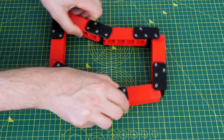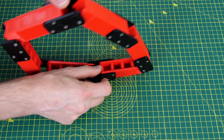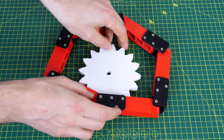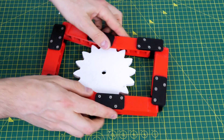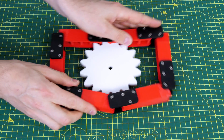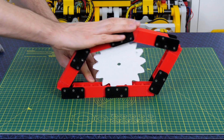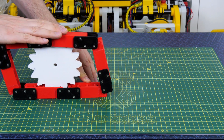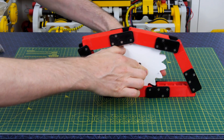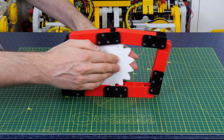I've put together six of those to make a Rotor Ped track just like the original footage. Everything seems quite free moving — there's not too much friction and it's looking pretty good. It's quite important to get those internal pegs the sprocket runs on at consistent spacing, meaning the hinge point for the next linkage is where the next peg would be, so the sprocket runs really smoothly. At least it's fine when I apply pressure to the top of the tracks, but if I turn the sprocket it's quite easy for the top of the track to pop off and for the sprocket to come out.